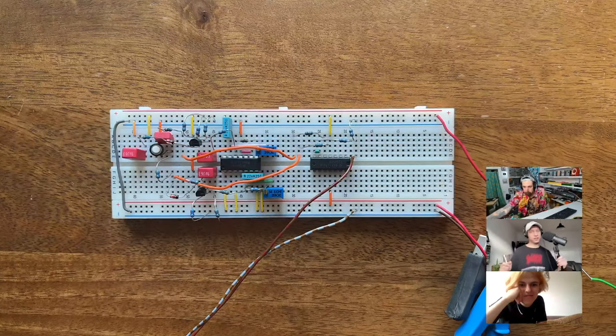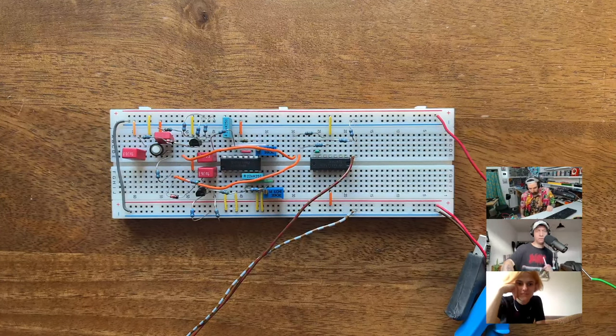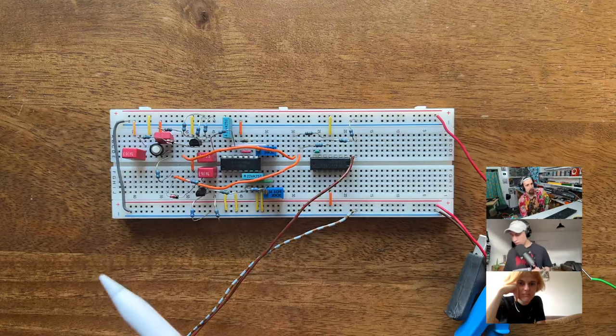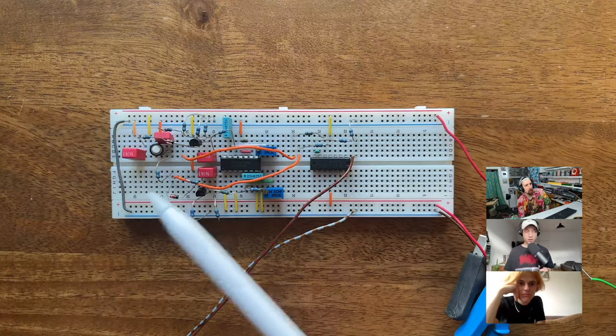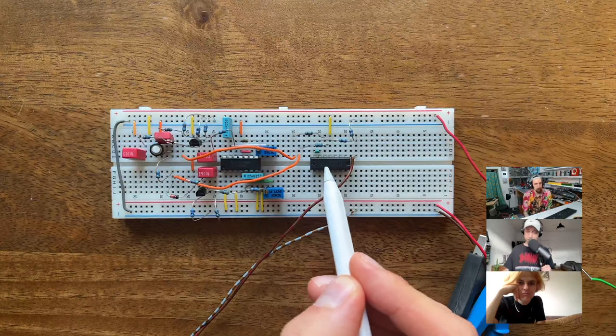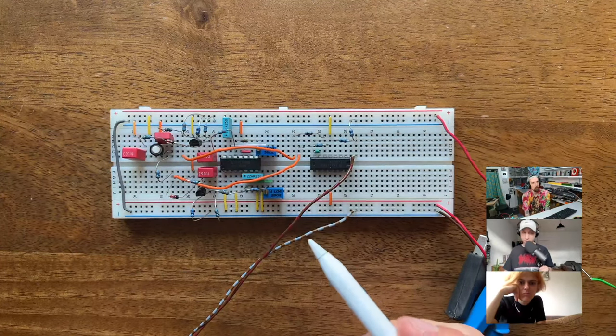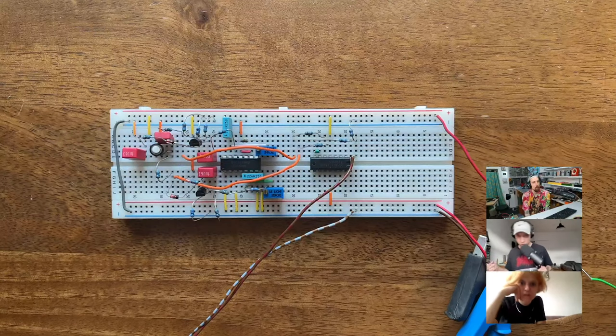Okay, perfect. The crazy thing is, this works because I just kind of by accident figured out that as long as I was feeding the output of these VCAs into my audio interface directly, I had the problem that it wouldn't shut up. At some point I thought, maybe there's an interaction with the interface, maybe the interface has some capacitance that keeps the VCA going. So on a hunch, I added an op amp chip and set up a buffer, and fed the two outputs from the two VCAs into the buffer. And what do you know, it just works. That just shut it up.